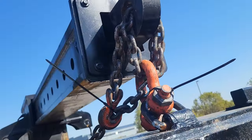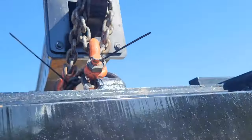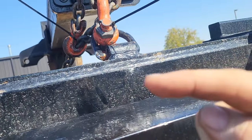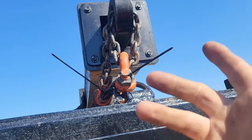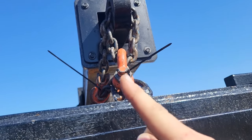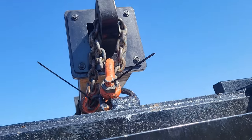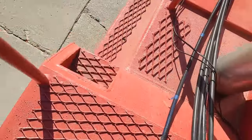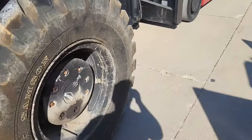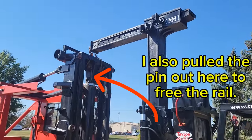All righty. Got our rigging. Now you have to imagine my eyelet is going this way and this hook right here is going this way. So if I was to just chain it like that it would want to twist when it came out. So I put a shackle on there so that way my lifting point on both sides is in the same plane so it doesn't want to twist. And then I put zip ties on there to prevent the chain from slipping off and my nut from coming off that shackle. So here we are ready for our lift.